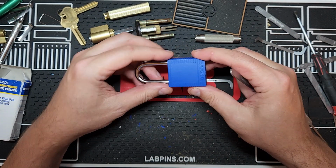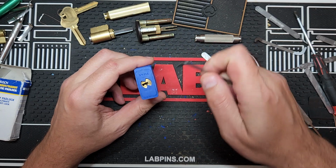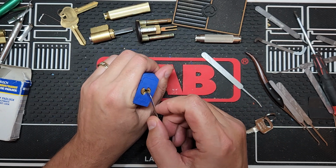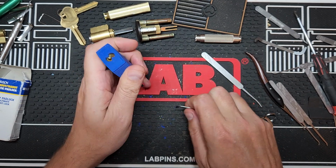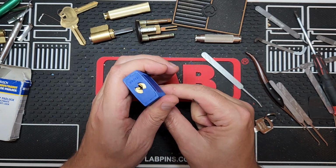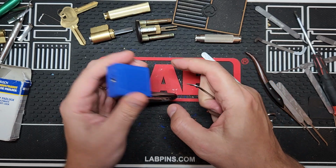So I wanted to revisit a couple of things, because I think it was Jake Gabriel who also mentioned that while the lock is picked, it's not quite to 90 degrees. So this hasn't dropped, which I mentioned, but I also did not mention that if it gets overturned, at 90 it'll open, but if it gets turned beyond 90, it won't open. There's a gate that it has to hit in order for it to come open.